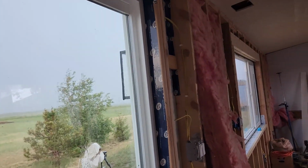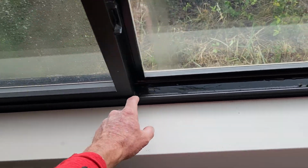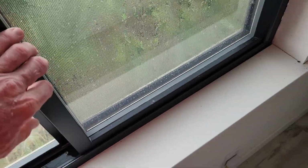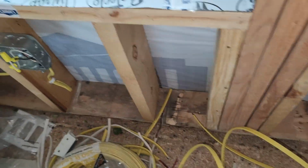Before it does dry, you want to get in there to all your areas, check down below, check in the corners before you start putting trim up, making sure there's no water in the cracks or crevices, and we're looking good. This is something I also have to address. The drainage area for this side is not very good, so in heavy rain it actually gets water on the inside of the sill because it's not draining properly. This side's okay, but it's this side I need to get in here and deep clean. So what I'm getting at is take the time, triple check everything before you button up the hatch, because once you do, remember that could be potential mold, especially if it doesn't dry out properly and you have some issues with water.